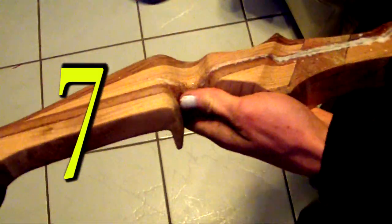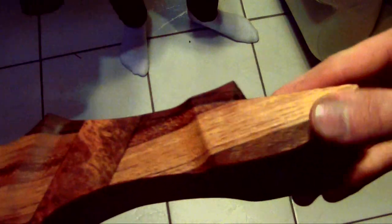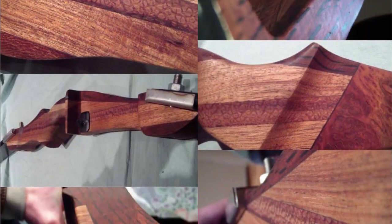The final and my favourite step is oiling it. I normally use a 2-to-1 linseed oil and kerosene mix, but here I'm using some random furniture oil polish. Use whatever you feel comfortable with. And now, enjoy how good your riser looks!